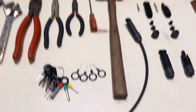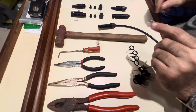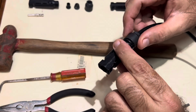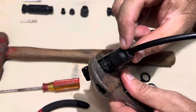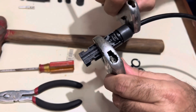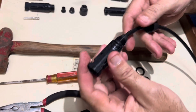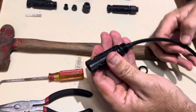I'll show you how you can go from this to this — it's not too difficult but it is a little tedious. We're going to start off with a regular MC4 connector. The first step is to take the ferrule off the back side. I'll stick a crescent wrench on here — these have a hex nut on them, sometimes they'll come apart and sometimes they won't. This one's coming off.